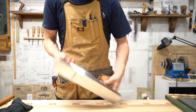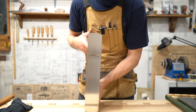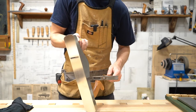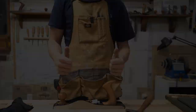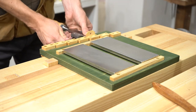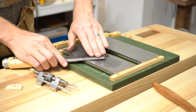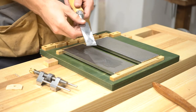I'll get it back in there, then take a look to make sure the iron is protruding as much as I want for the operation. I like to use a little hammer to adjust my blades — even in a plane that has a lateral adjuster, I find it easier to control. Then I'll tighten it down and I'm ready to get back to work. The cool thing is that this entire process is exactly the same if you're sharpening a chisel. I'm going to set this chisel to 32 degrees, put a little Honerite on here, give it 20 strokes, place it down, a couple of strokes back and forth to knock the burr off. And this one is ready for stropping.